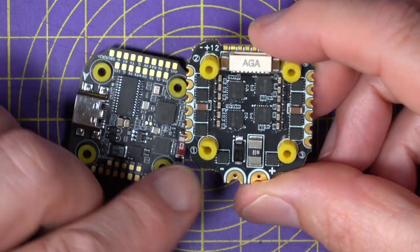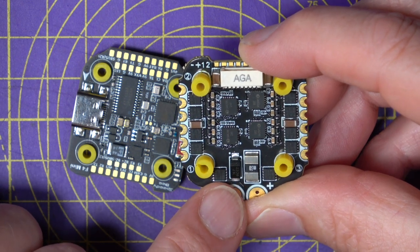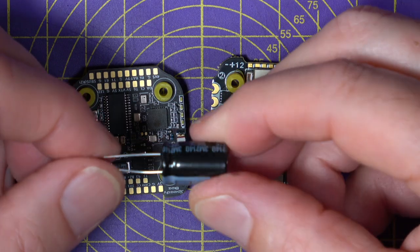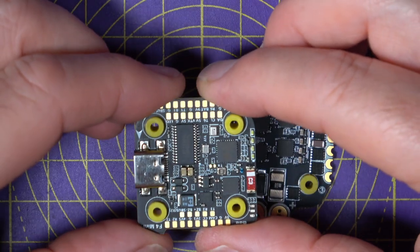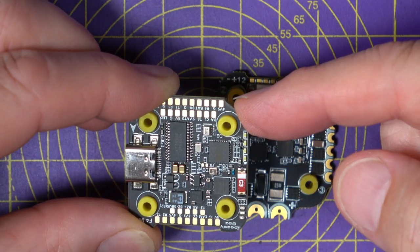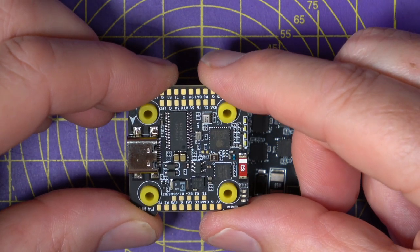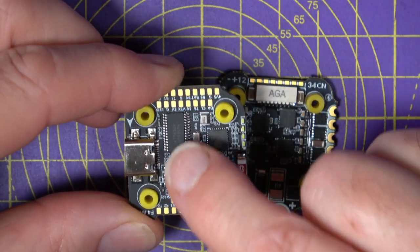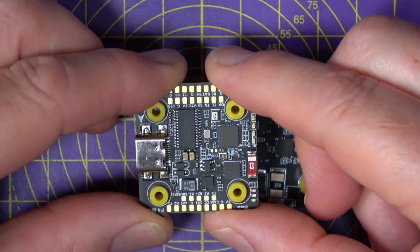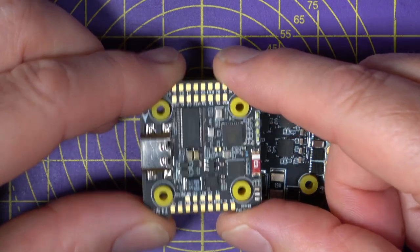On the flight controller there's a TVS protection diode to prevent accidental damage when you plug the main power in. They also include the low ESR capacitor that keeps things electrically quiet for your video. They've also made changes to improve the gyro filtering — this has a Max Linear LDO power supply chip independently powering the gyro, and improved capacitor filtering using a 100 microfarad tantalum capacitor. Anything that insulates the gyro from external noise — either electrically or mechanically induced — will make tuning the PIDs much easier, and anything built into the flight controller to reduce noise further is a great design feature.